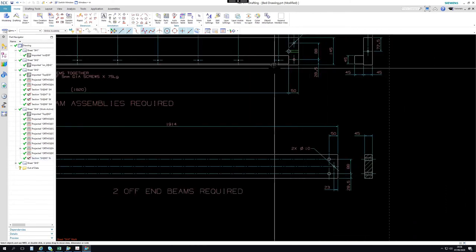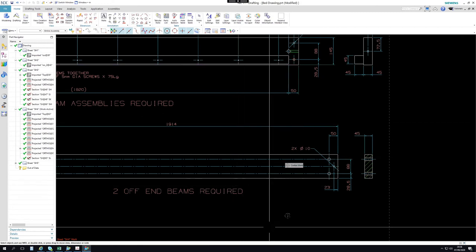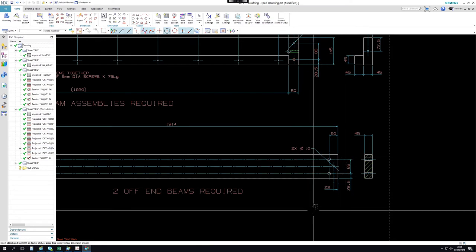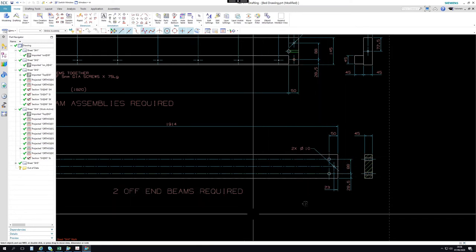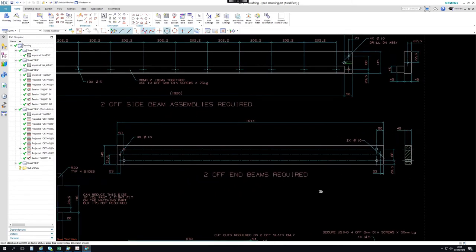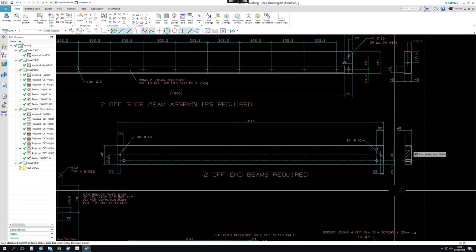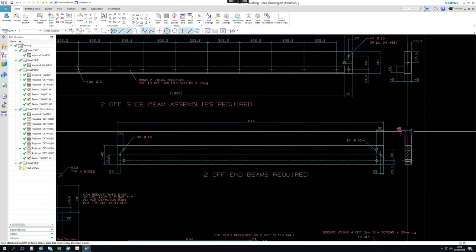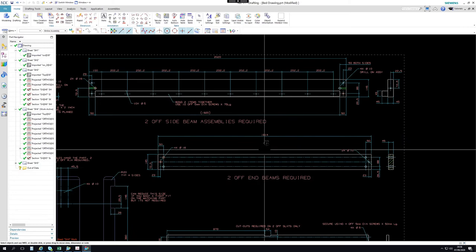You basically put this beam and this beam together with all the feet. You want to clamp them together, align the end faces, and then drill through the legs and into these components to make sure it all lines up properly. Again, this should be standard off the shelf planed material, and it ends up being about 145 by 45 by this length.